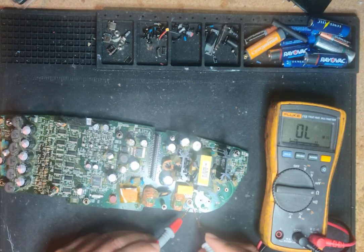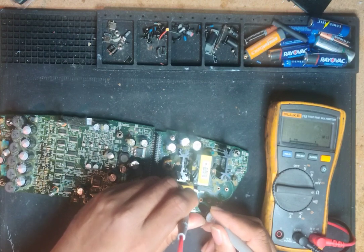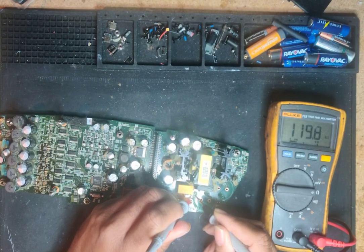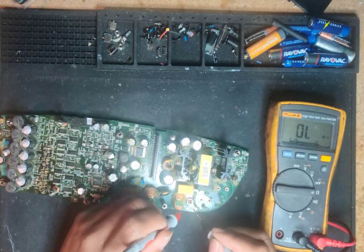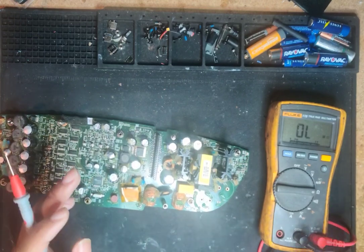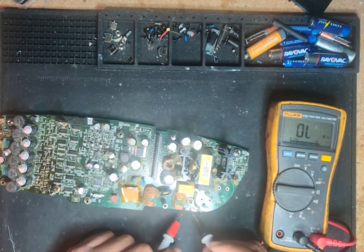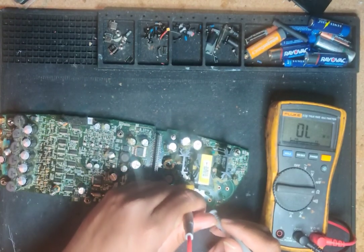They might just be open. That chip right here reads nothing, so I thought they were supposed to be around 120 ohms. But wait — because one was here and one was here when I read them in-circuit, they were in parallel plus the caps and everything, which changes the reading. On a bare parts board with nothing else in line, the reading would be totally different. Yeah, they were definitely gone — confirmed open. So we know now: 120 kilo-ohms — it's a K at the end — not 120 ohms but 120K ohms.